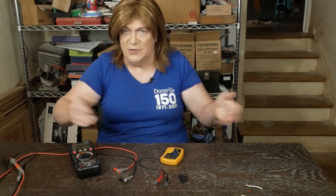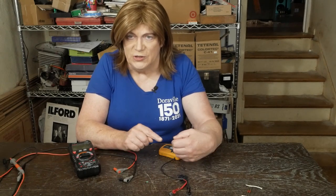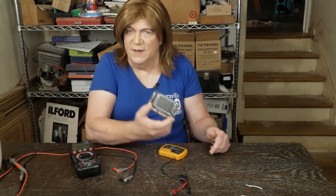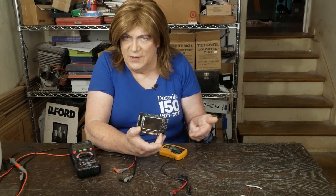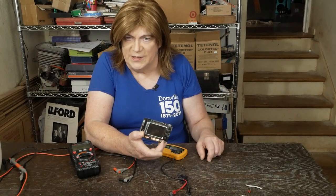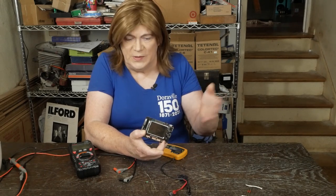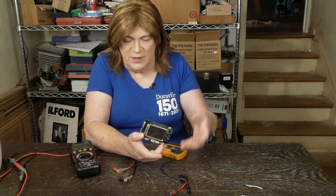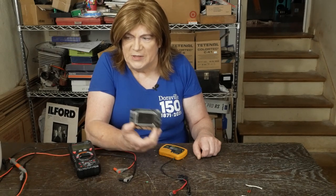It's real handy for channel-matching resistors so there's no difference between channels. It also has an accurate inductance meter that shows inductance, lets you set different test frequencies, and shows you the DCR. Unlike this cheap $25 meter I showed previously — which multiple people online confirm has a junk DCR section — this one works properly. The cheap one also requires external USB or battery brick power, which makes it basically money thrown away.